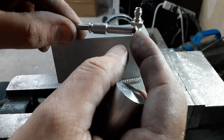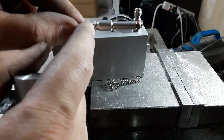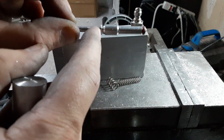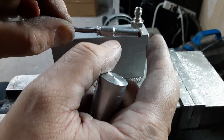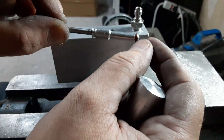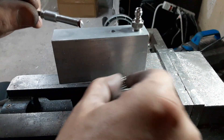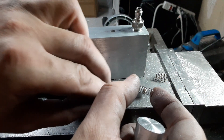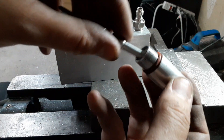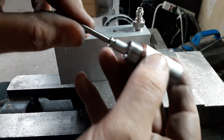Normally, you have what they call a vent going from the front somewhere down to the base of the seat of the poppet, so that when it fires, there's a high pressure area on the transfer port right around here. It goes back in to refill, equalize, or reseat the poppet — so that balance chamber gets a spike in pressure real quick so that the poppet comes back. In this situation, although people say it doesn't work, it does. This is not vented, but it's got sufficient spring and a small enough plenum where it naturally wants to return to its home position.